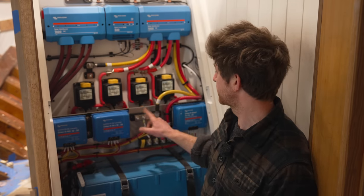Now, there's actually an electrical button on the Morse control itself, which will slowly turn the engine around using the electric motors until those dogs are in the correct position, and then you can move the Morse control to engage them. Now, that's not an operation which is going to have to happen all the time, but it does have to be easy to do, and Joe has been working on the ins and outs of mounting all those units.